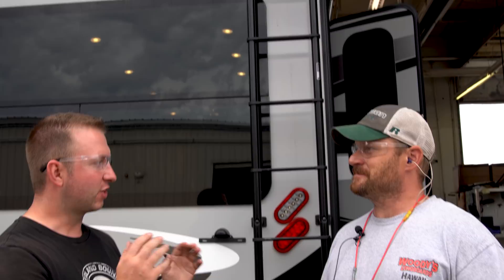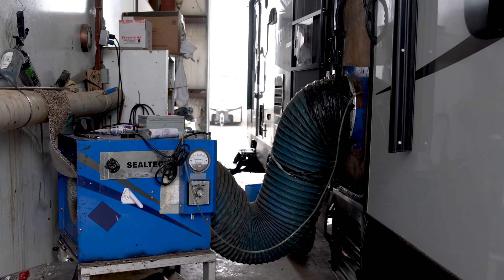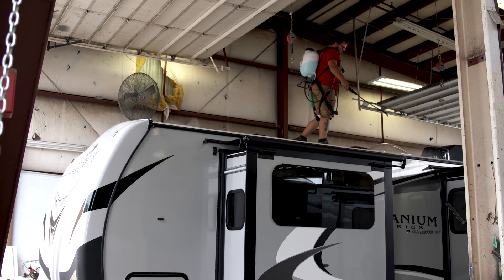Casey, you're the lead in the PDI department — what's your role? My role is to walk into this unit and behave like an owner — like I'm going to buy this unit. When it rolls out of here, it's ready for sale, ready for somebody to walk right in and say they love it, and I've put my stamp on it. We start from the outside and do a complete walk-around top to bottom, making sure there's no defects — if there is, we either correct it or have somebody come out and correct it. We also flood the tanks, do water tests, electrical tests, all functionalities, and then fit and finish to make it beautiful.